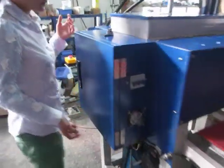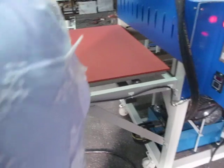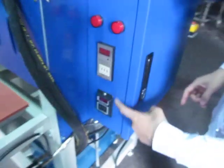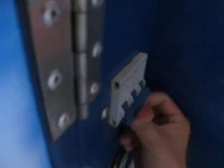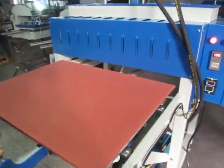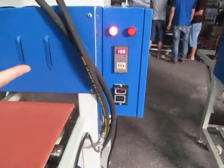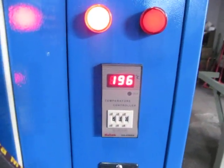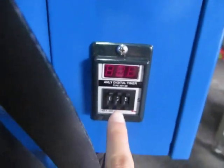Now if we want to finish the job, we also need to turn this off — turn this cover off. The machine will not work and all the lights turn off. But if we want to test the automatic mode, let's start the machine again. Turn this switch to the right. We test the automatic mode. Remember, the temperature and time are already set: the time is 25 seconds, the temperature is 196 degrees, and we test it at 200.